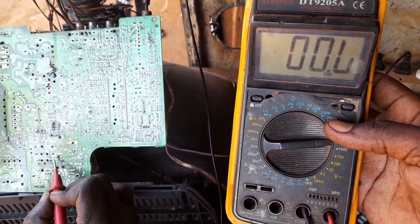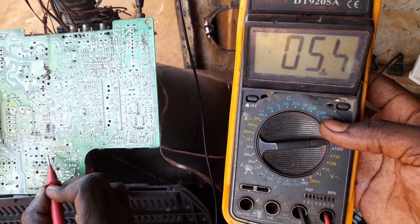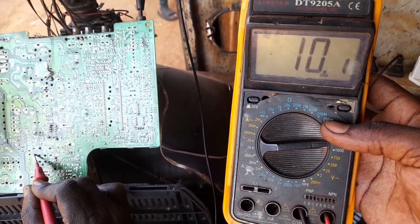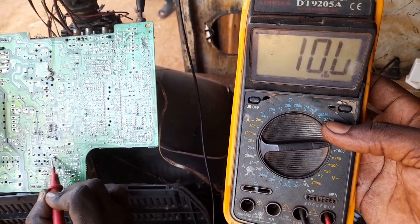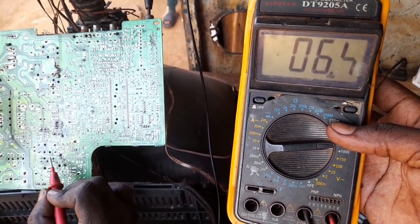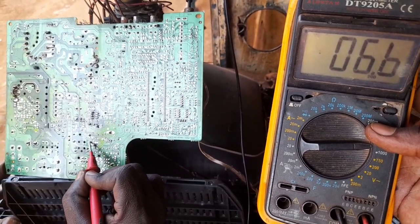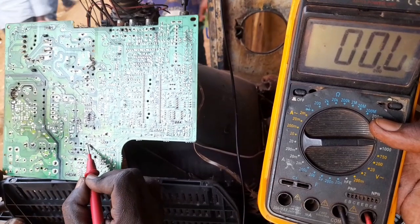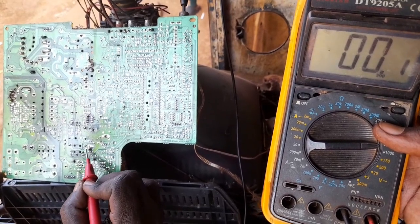Here, we have used the same voltage, this 11, I'm going to show you, it is here. Before voltage drop, it is 10. I think you can now see. The other dropped voltage gave us 8 volts, this one, and then this is 8. Then that same 8, this is 10. We also drop 10, because we want to get, you can see, here we get 6 point something, which is roughly 7 volts. So out of that 7 volts, we use a Zener diode on the base of this transistor, of course, here.